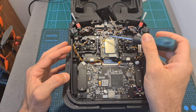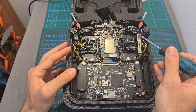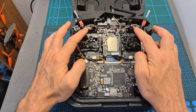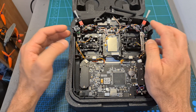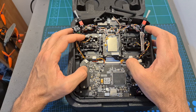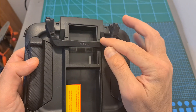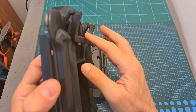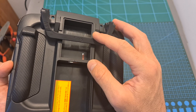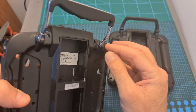In addition, if you would like to convert your mode 2 radio controller to mode 1, you will need to move this metal part along with the spring to this position, and move this other metal part along with the screws to the other side. As I mentioned before, all the internal components are connected using normal connectors, so changing a broken switch should be pretty easy, and also upgrading the gimbals to hall sensor ones and replacing the screen with a touchscreen version in case you have the cheaper version. The foldable handle of the Jumper T16 is fully compatible with the TX16S, so if you'd like a slimmer profile you can purchase it separately for a pretty good price, since now the Jumper T16 is being discontinued. Another way to get a slimmer profile without purchasing the foldable handle is to simply reverse the original handle and mount it in this position.